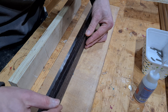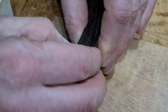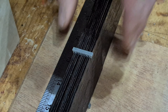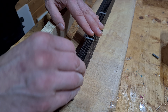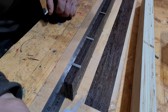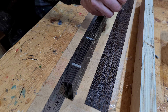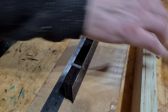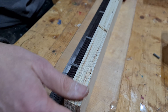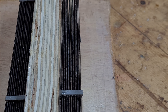It wasn't obvious when you've got very thin layers unless you look very closely. Once the layers were in place the widgets could be applied to the top — more of a pain to keep everything in alignment. But once one was seated correctly you could take the next widget, put it close to the previous one, and then in a comb-like manner pull it out to the place you need. To get the outermost strips into the system I found it best to drop some CA glue onto the ends of the widgets, then position the end strip and bring in the support from the next wall of the mold. The widgets must be used right up to the ends of each strip section to keep everything in alignment.